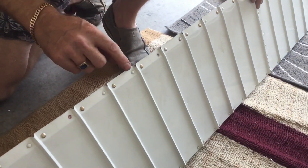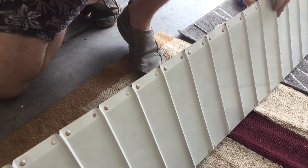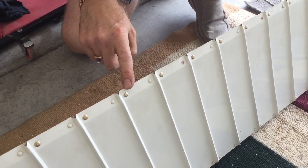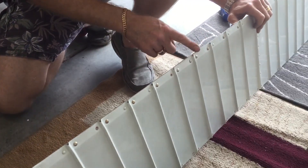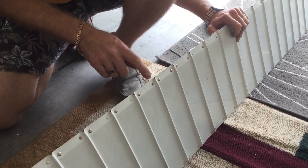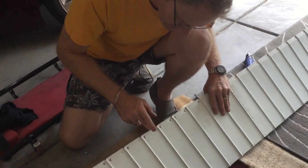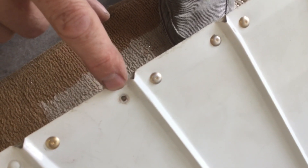You can see there's an extruded lead balance weight that's riveted between two plates here. The original rivets were an eighth-inch plain aluminum rivet. The ones we're replacing them with — we've actually already done both of these — are 5/32-inch diameter alodyned aluminum rivets. We started with three of them as a test case, and as we started drilling the other ones out, the heads started popping off some of the remaining ones. If you look really close, you can see how deep that rivet was actually fractured and broken.